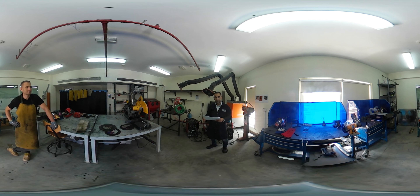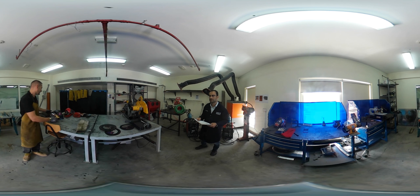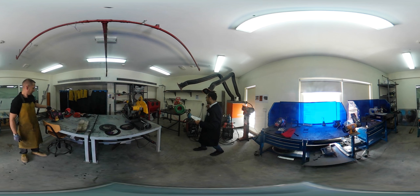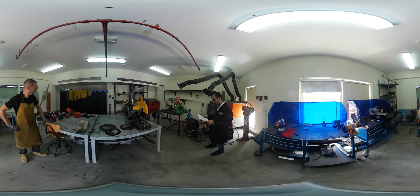Ultraviolet radiation — that is the light which comes from the arc of the welding. This is very strong; never look at it with bare eyes. We will be wearing welding helmets, which will be automatically activated whenever an arc is present. If they don't activate, let us know. Always make sure people behind you are wearing a mask, and notify them before you start welding.